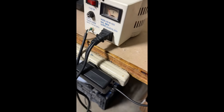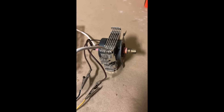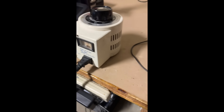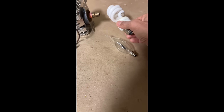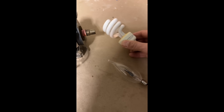Let's move them off like that. Let's turn on our high voltage — you can hear a little bit of hissing from the high voltage. Now let's turn on our filament, pre-adjusted to five volts. The filament is now activated. Now let's see if we're getting any microwaves. I'm going to bring this bulb near to it — and there you are, there are some microwaves coming out, enough to light that bulb. Now let's try the CFL — see if it'll light the CFL. There it goes. So enough microwaves to light the CFL.